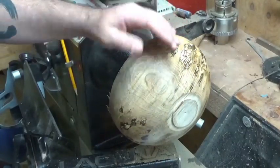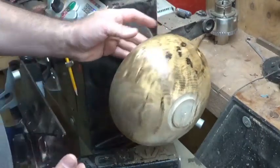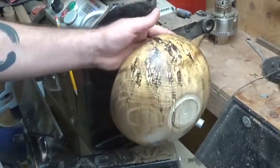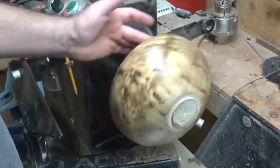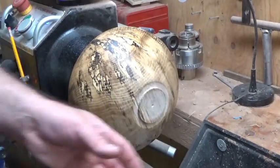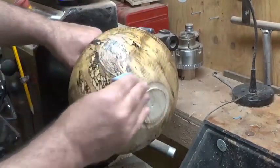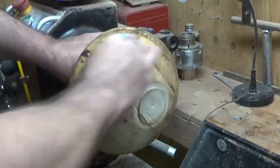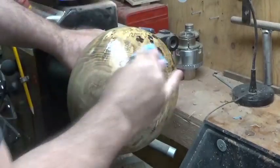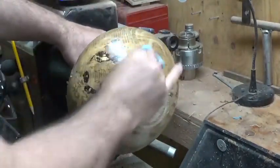Yorkshire Grit is going to do your fine aggressive sanding now. From 320 it's going to bring it down to 1000 grit, and then with the microfine we'll get an even higher finish. Then that will be before Hampshire Sheen Glass and Hampshire Sheen microcrystalline wax. That's a pretty beautiful piece of wood. We're going to use Yorkshire Grit and wipe a thin layer over the whole bowl. Is there anybody that hasn't heard of Yorkshire Grit? If not, comment below. Very popular in the woodturning world. Glenn Senior, you're a genius mate.